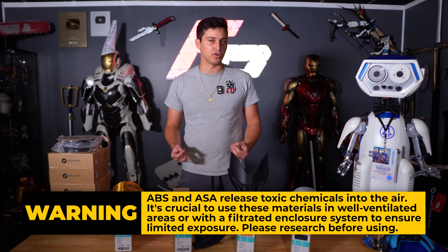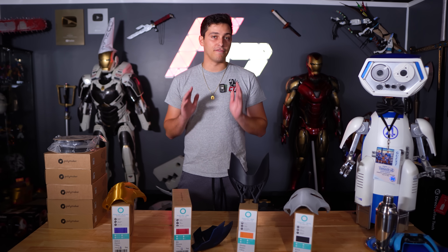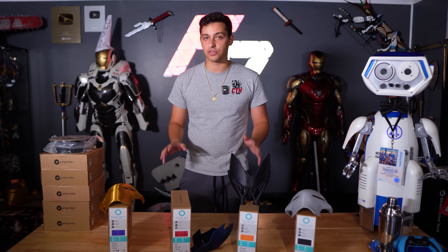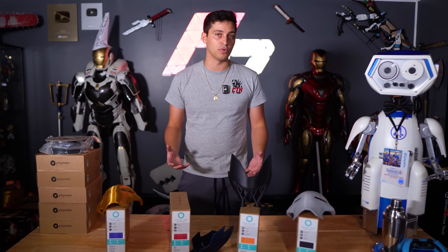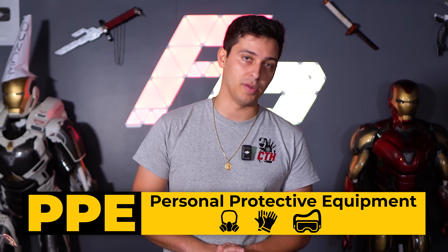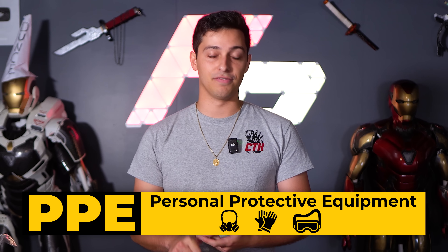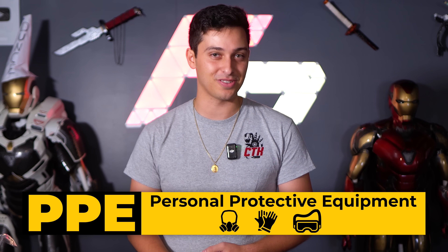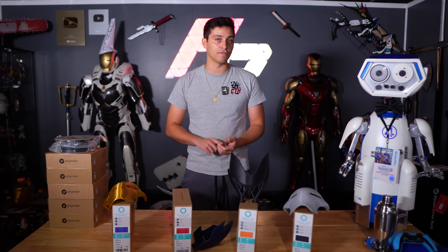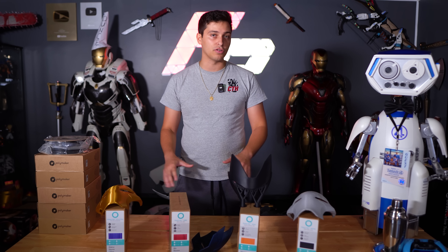It's the same reason you don't want to be smelling burning plastic, and it usually smells pretty bad. If you're going to be following any of the instructions in this video to be chemically smoothing or just printing ABS or ASA, please make sure that you have the proper PPE. If you're printing ABS, don't do it in your bedroom — it is very toxic to be printing next to you where you're sleeping constantly. You need good airflow, proper filtration either in your printers or in your workspace, and anything involving melting any of these plastics requires a respirator.